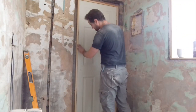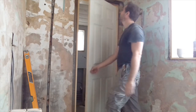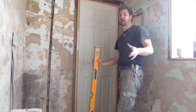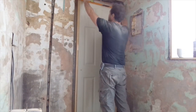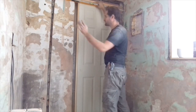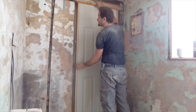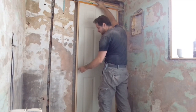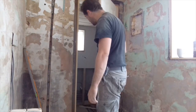Right, so there we are — we've got a door liner installed. What I've done is I've put two screws in the side of the door to keep the same lever on. Before you say right that's done let's wrap up, it's always good to do a final check — there's no harm in it. That's what makes people say oh wow, you're really good at that, because you check, check and check again. You know the old saying: measure twice, cut once. So you get your level, your straight edge, you make sure the left and right frame is actually touching the spirit level, and obviously that is not being forced out by the wall. You pull the door using the screw and you look down the side of the door and make sure that that is as true as it can be — spot on preferably.